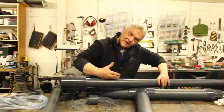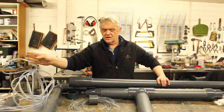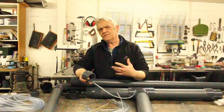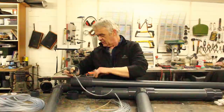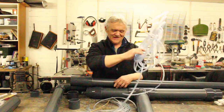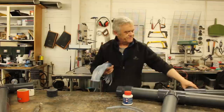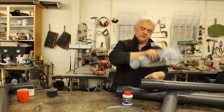The water rushes down and at this point we need to mix it with air. The way we do that is with five-millimeter polypropylene tubing — I've cut a bunch of half-meter long strips and I'm going to glue them in there. That'll make a cluster of pipes, and we need a fill factor of somewhere between 60 and 80 percent. When the water comes in it will rush around here, filling the tube, and then it'll be forced down — and that forcing down will suck the air through that little hole. There are 32 of them and it's got about a 60 percent fill.